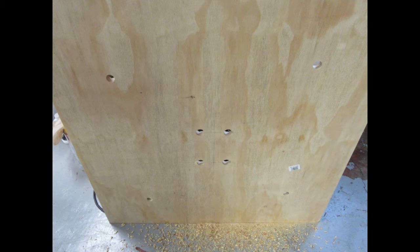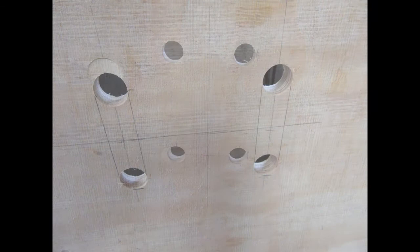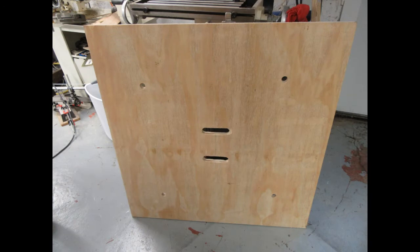To make the deck easier to transport by one person — since three-quarter-inch plywood is fairly heavy at this size — I put in two oblong-shaped carrying slots, positioned so a person can put the board under their armpit, reach down and grab whichever handle is the right length for their arm, stand up, and carry it with the bottom of the deck about four or five inches above the ground. I drilled one-inch-diameter holes with a Forstner bit, drew lines between their tangent points, and used a scroll saw to cut them out to the oblong shapes.